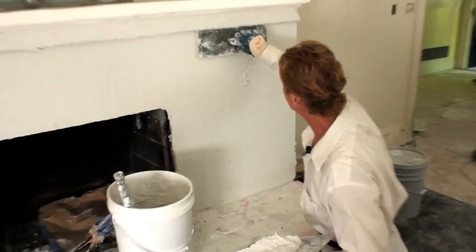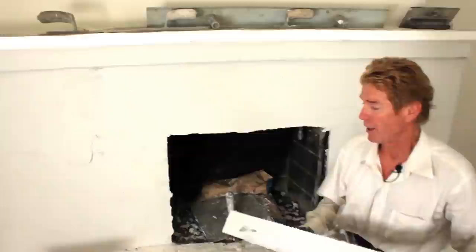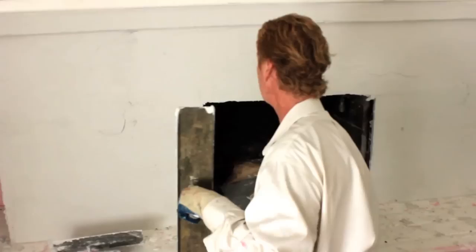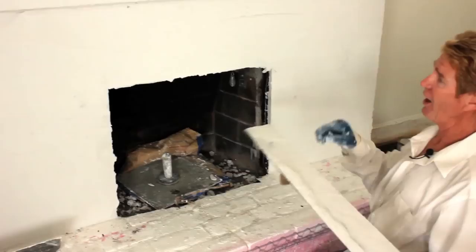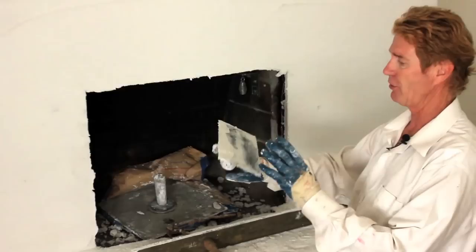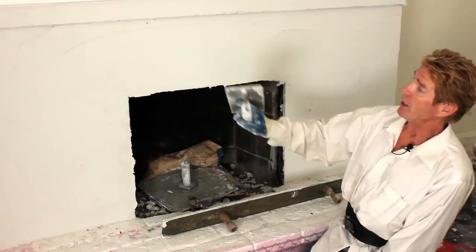What I generally do now is leave this particular finish rough. A lot of folks ask why I never use Structolite — because I do same-day systems where I do a scratch and brown coat and finish. This particular material you leave rough so it can accept the third coat. If you want to do all three coats in a day, that requires a skill very few people possess. Without the accelerators, it just sticks like glue on the trowel, so it doesn't work. That's the answer to folks who ask why I never use Structolite — because I do same-day systems.